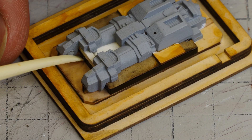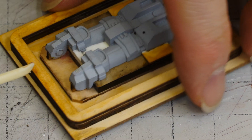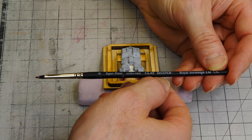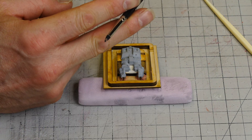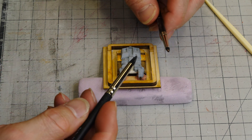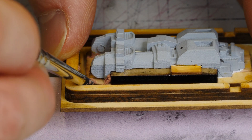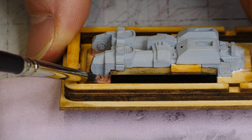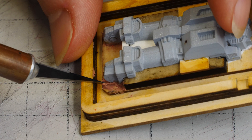All the work requires special little tools — either clay modeling tools or tools that I've made. This is a taper point extra firm clay scraper from Royal Sovereign Ltd UK. I have a couple of these, including a bigger one, depending on what I'm doing. They're great for smashing clay — very much like little fingertips. I'm just jamming the clay into the undercuts or wherever there are gaps, then coming back with a tool to clean things up and make it nice and flush with the part.